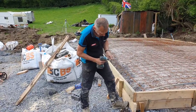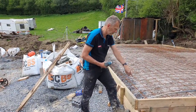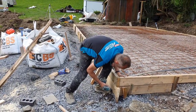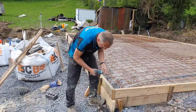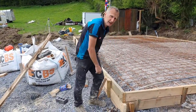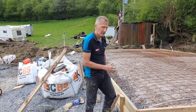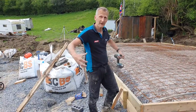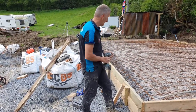I'm just putting the last couple of bits of shuttering on the edges — there are a couple of little places where concrete could leak through, so I'm just popping them in. Then we're going to mound up the stone against them. For the shuttering I've used six by two timber — you could use five by two — but with a lot of weight you really want hefty timber, not six by one. Make sure you've got really strong posts, otherwise it can bulge out when you pour.